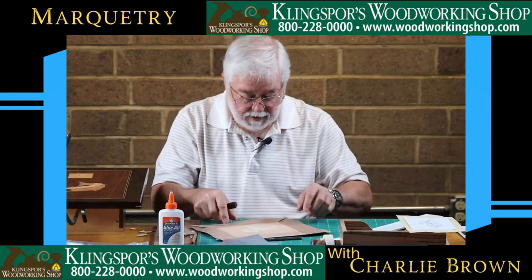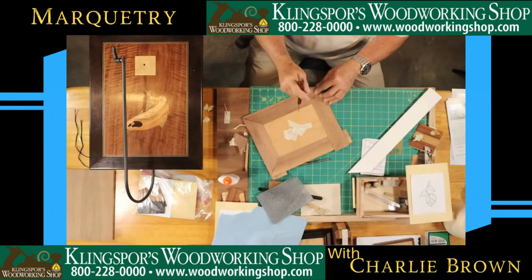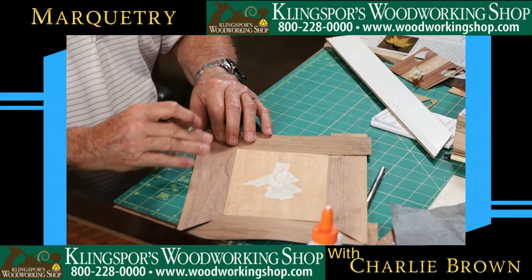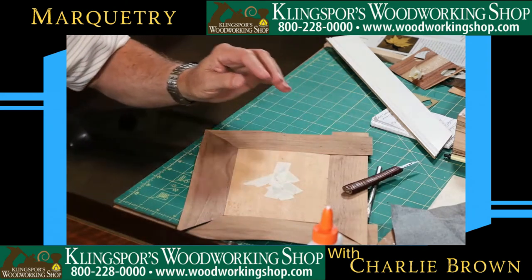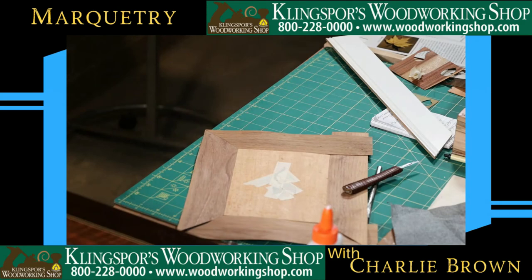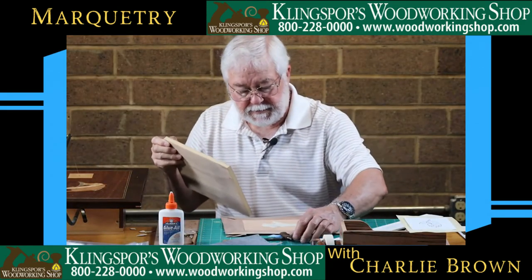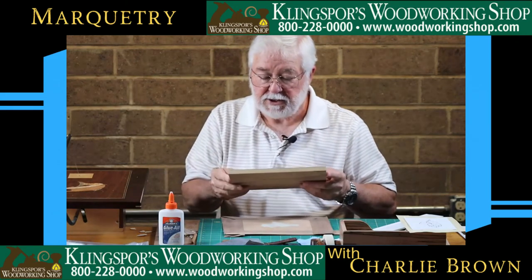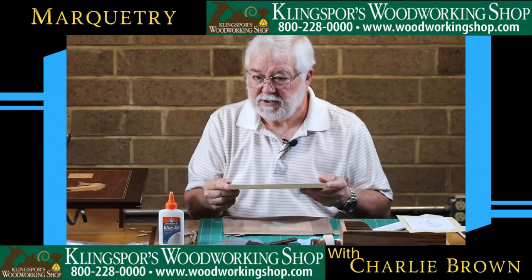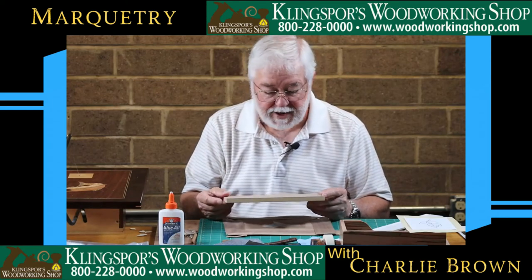Okay, and see it, now it matches because you cut through one to get to the other, so it matches. Once that process is done, you take your piece of MDF. Let's talk a minute about MDF and the substrates that you can use to do this. MDF is not the only thing you can use, but it's chosen typically because of its stability. It's not going to expand or contract.